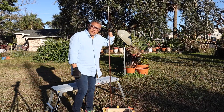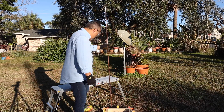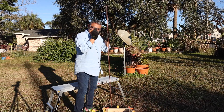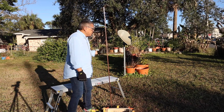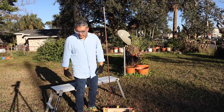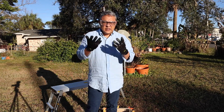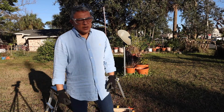Right now this is an eight-foot ground rod. I just pushed it into the ground, and a tip is you take one of these acorns and put it on the rod itself, so when you start pounding on the rod sometimes you get a mushroom on top of the head, so when you try to put the acorn in it won't be able to fit. Also wear eye protection in case any metal shavings might be free from when you're striking the rod and get in your eyes.